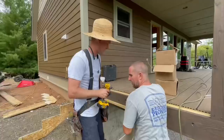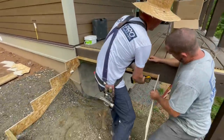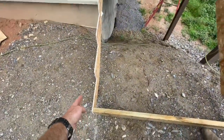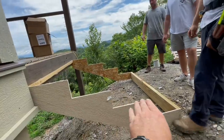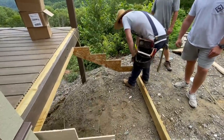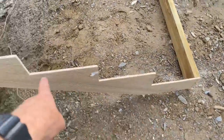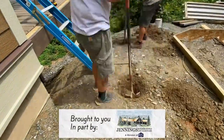Jamie and Jason are building a digging template — not the real stairs. It's a template so they know where to dig the footings for the bottom of the stairs and set the posts, so we don't waste time digging holes in the wrong place. These have extra wide runs so the stairs go out far enough that they don't land in the pit. Custom designed digging template — make the foundation, then make the real stairs.